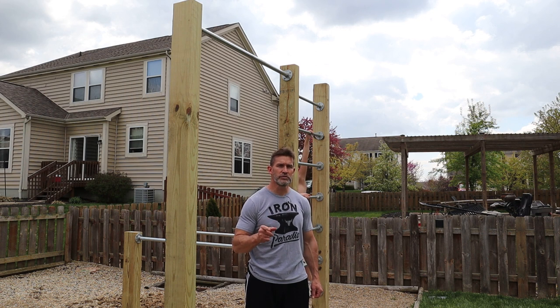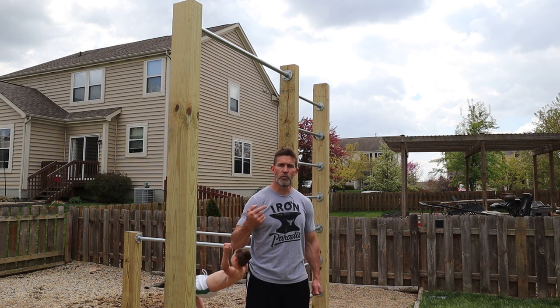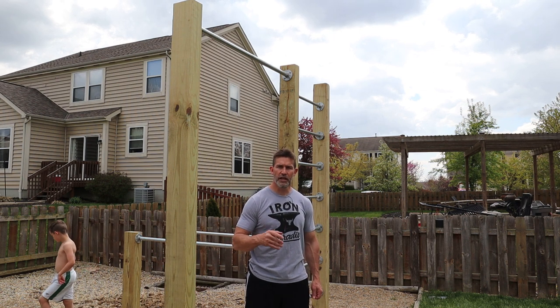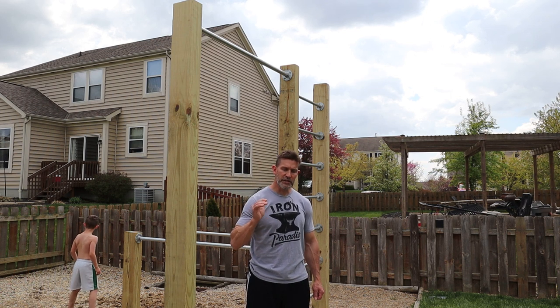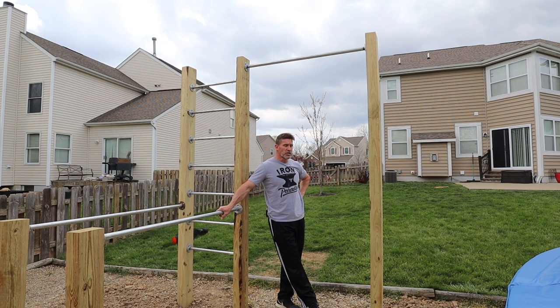One thing to be careful about — when using a power drill, you don't want to be overly aggressive with a 1/4-inch galvanized screw. You could easily apply too much torque and spin the head right off. So go slow, drill a pilot hole, and maybe finish it with a ratchet. I want to consider getting an auger. You definitely want to call your local utilities company to have everything marked before you dig that far into the ground. In Ohio we have OUPS — it's just a phone call and they come out a couple days later to mark all your cable, power, and gas lines.